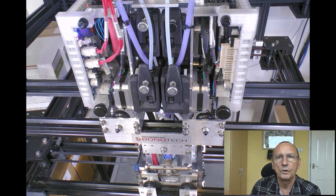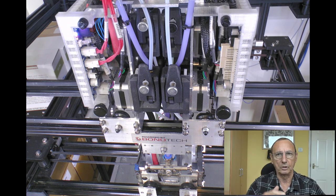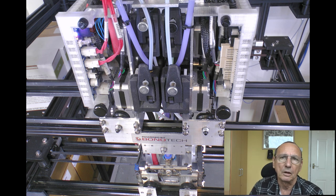I was never entirely happy with the original arrangement because it made it a bit awkward to access the extruders and connectors on the board. I made it so the boards could hinge down or hinge up so you could get to the connectors — you don't need to get to them very often, but still wasn't very happy with it, even though I wanted to put the boards close to the motors to keep the wiring short. Then I looked at the 6HC and thought, how can I fit that on the extruder gantry — and I couldn't come up with any viable way of doing it.